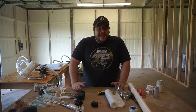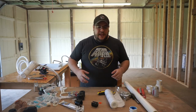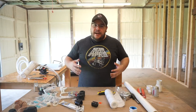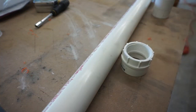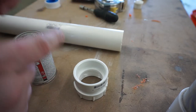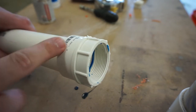It's exactly a week later. Hannah's sick so it's just going to be me. I went on a Home Depot run and picked up PVC pipes, some fittings, an end cap for the faucet connection, and a couple other things. We've already tested the system and it seems like it's going to work, so let's put it all together in its final version. I'm replacing the old drain piece — I just need a straight shot into the bucket, no P-trap — so I got a longer piece of PVC pipe and cemented the two pieces together with PVC cement. Make sure each surface is clean before applying, then apply cement, stick them together, bottom it out, and give it a slight twist. It's a fairly instant bond — about 30 seconds — it melts the surface and basically welds them together permanently.